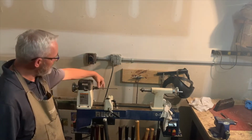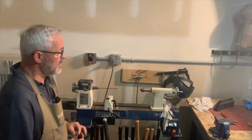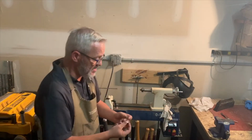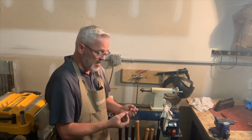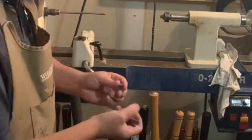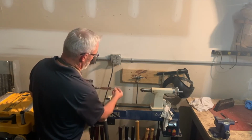Within the lathe, you're gonna have actually your mandrel. So the mandrel is just really, again, 7 millimeter tube or pipe here. So what we're gonna do is use these bushings in partnership with this mandrel. Now the bushings really are the most important thing to pin turning or razor turning, because it really makes it where anybody can be an artist. You take your bushings, put them on each end. So we're gonna do a bushing, and then we're gonna do our razor down there, another bushing.